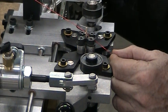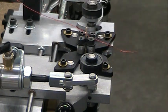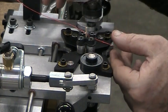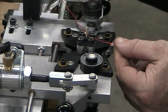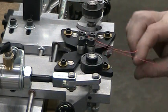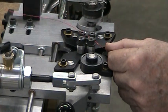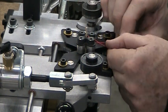I cut 34 inches of 25 gauge wire and do 47 turns, then put the core in. I use these little pliers to get it in there. I'm mainly going to show that if you take your time it will run pretty good. The wire, when it's long, wants to snag on everything, so I slowed the hook down so it doesn't go down as quickly.